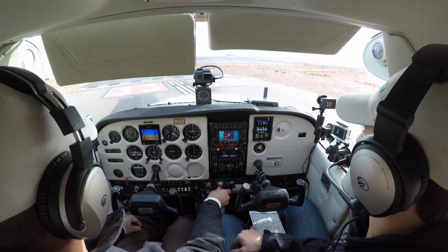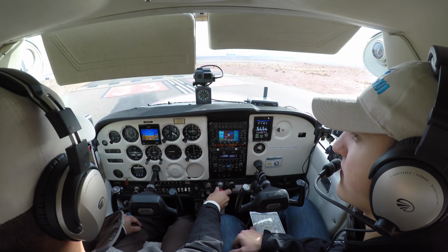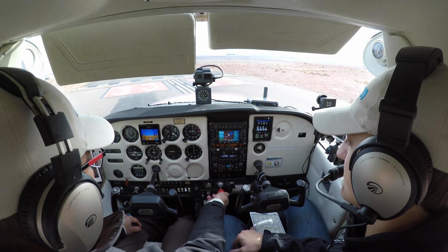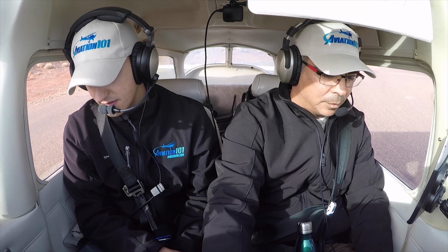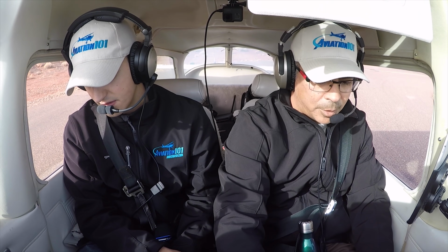Alright, getting 20. Alright, that's where it started to drop. There you go. Perfect. That's exactly how I'd do it. Carb heat is as soon as you come back to idle. Alright, carb heat off. Carb heat is off.